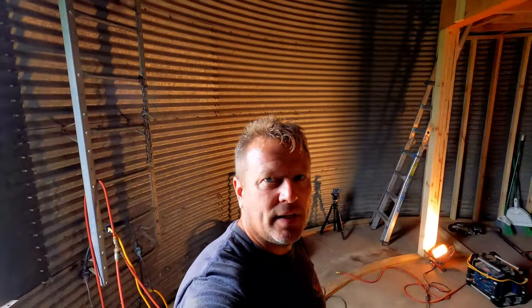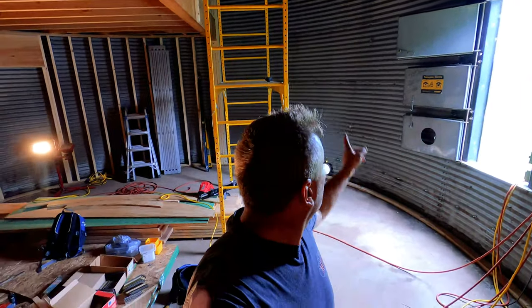We're back on the inside framing. Today we're going to be doing the tall walls — they're 18 and a half feet tall. Our studs are 12 inches on center, so I've got 18-foot 2x4s here. Nathan's bringing them all over and getting ready to start cutting them all. Had to bring in scaffolding to get up high enough to run this wall. It's a tall one.